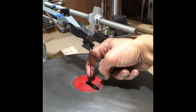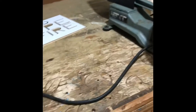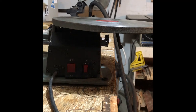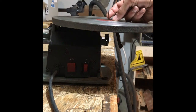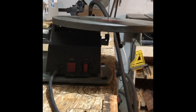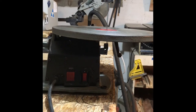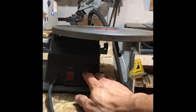The manual also mentioned that when you have the right tension, it should sound like a guitar string — like a C major or something. I don't know music. If it's anything like the bandsaw, you should be able to deflect between an eighth and a quarter of an inch on a blade. I got this thing situated and it feels okay. There's a lot more sophistication with the quick release and everything as compared to the Dunlap and the 1920s model. So I got it plugged in, I'm going to give it a test and hope that it works and it doesn't blast me in the face.